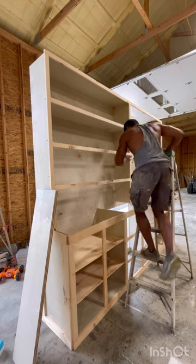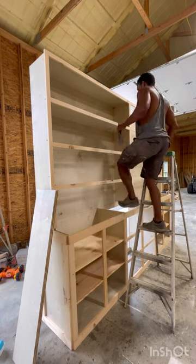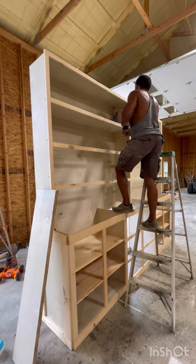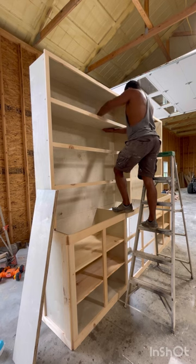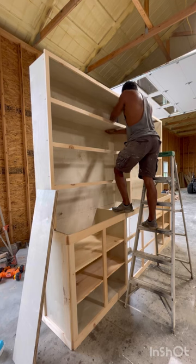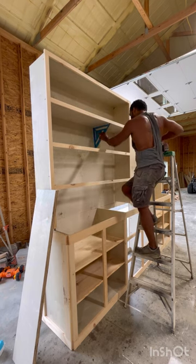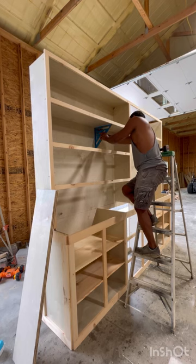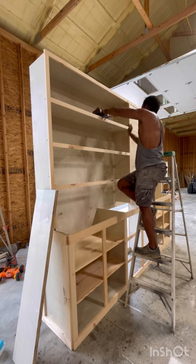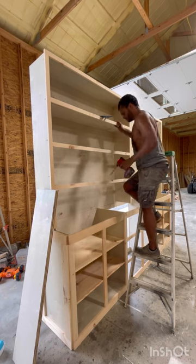I went around all the corners — I think I put about three or four pocket holes on the front, three or four on the back, one on each side. Started from the face, got it about even, got those pocket holes in, then came back with a square and made sure everything was level and the same height. Rinse and repeat all the way down — I started at the very top because I thought it'd be the hardest, then went down and back up the other side.